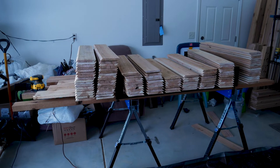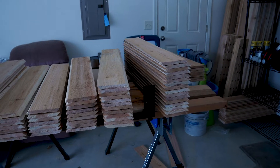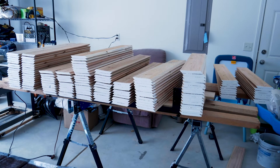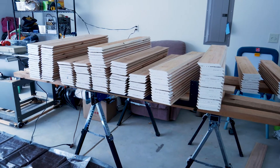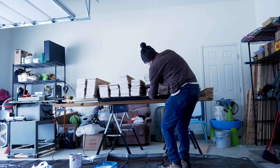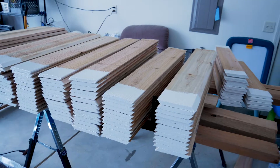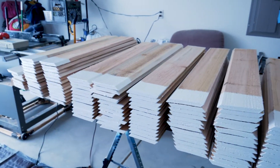We started out with cedar fence posts from Lowe's, cut them all to size. We're using cedar because it will never rot, at least not anytime soon. Then we had to paint them with oil primer to soak in and protect the cedar. I painted each edge because once assembled we'll never be able to get paint into the cracks after the fact. I basically assembly-lined it on the ends with a roller, then painted the top and bottom individually for each louver slat so we can assemble them.